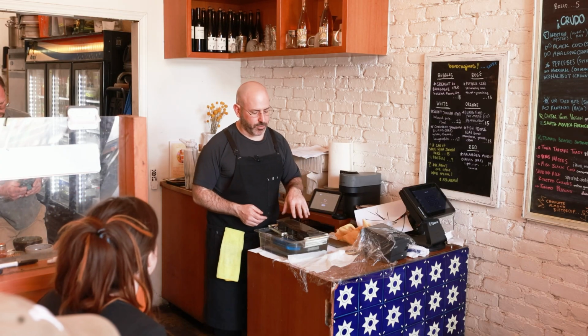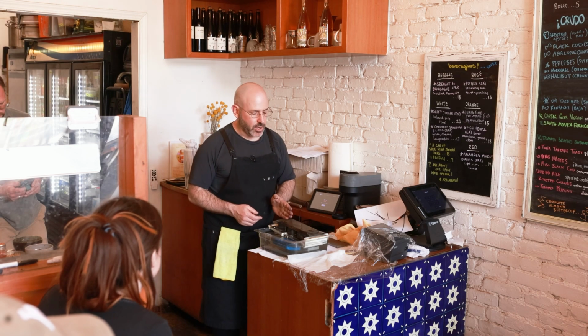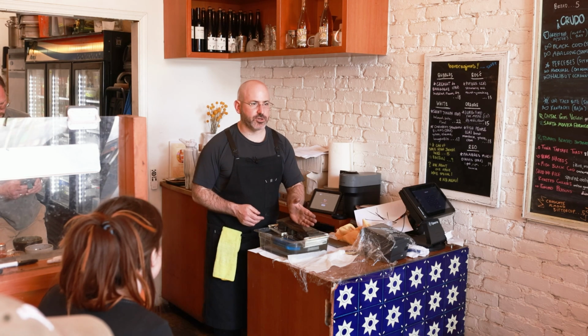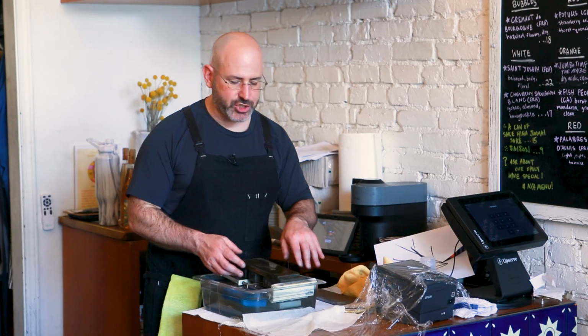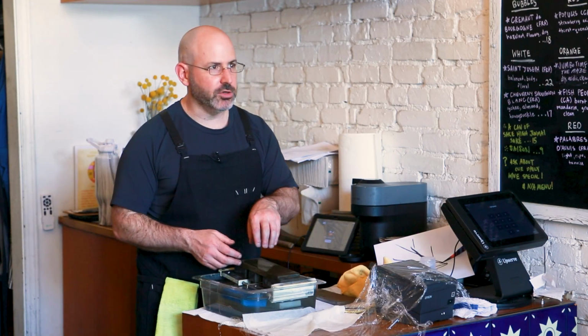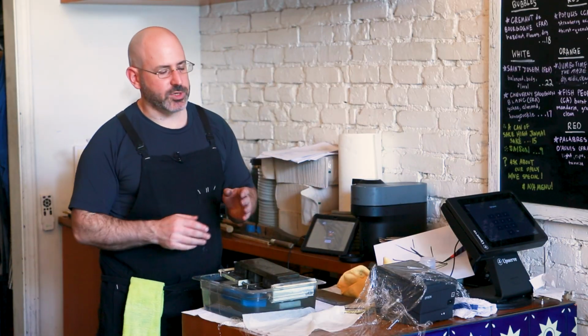And that's going to sound really weird, but for pressure, not just how much pressure you apply, but where that pressure is applied. We want to make sure our pressure stays over the center line of the stone so it's evenly distributed across the surface of the stone. So we're not applying pressure out here or out here on the edge of the stone, but rather always in the center. So my left hand, you're the lefty? Yeah, right hand will stay in the center of the stone as we go.